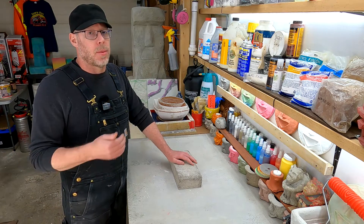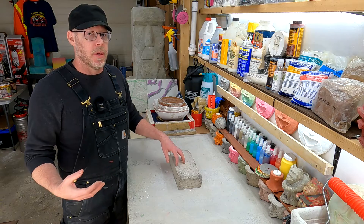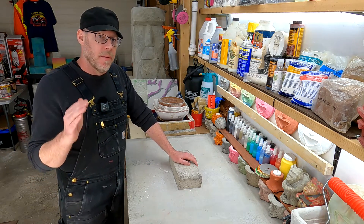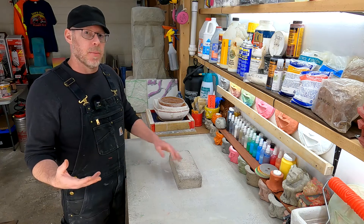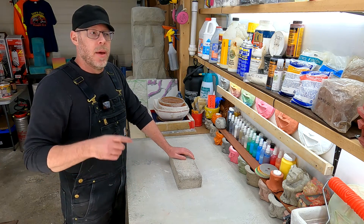When applied through high velocity, you can apply new concrete to old concrete, and under laboratory conditions there is no discernible cold joint between the layers. Very interesting — though not applicable to the average do-it-yourselfer or benchtop level. You're not going to be able to achieve that kind of velocity when applying new concrete to old.